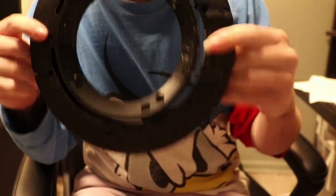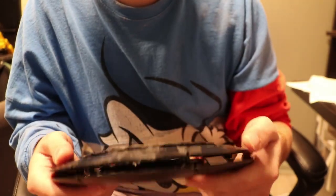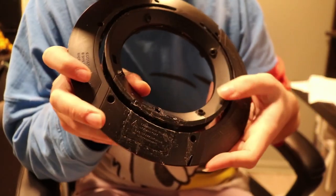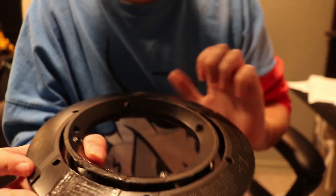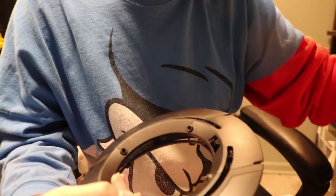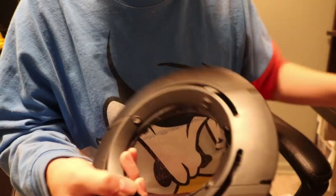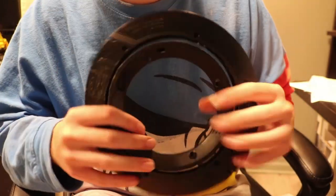Two days later, this is where the C-ring is cut. What I decided to do — I'm going to sand off all of this and paint it. It's going to make things a lot easier and look a lot more clean. I used the Dremel, got all that out, and then I glued the battery compartment down so I could go all the way across, making it a full C-ring in the back. I'm going to sand all of this off and use some Bondo body filler to fill in the battery compartment as well as the switch hole, since I'm not going to need that for my build. Since I'm using the Nano Biscotti, there's already an activation switch that uses a simple push button — I'm going to use that same design. I'll also put a recharge port in one of the drilled holes.